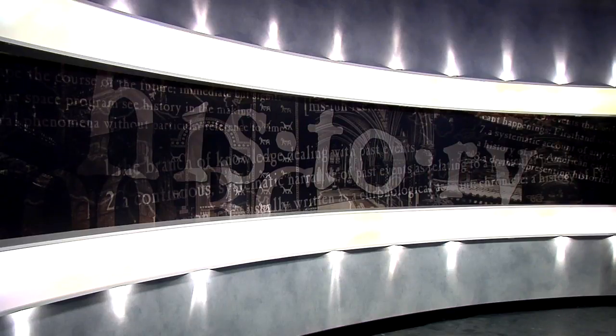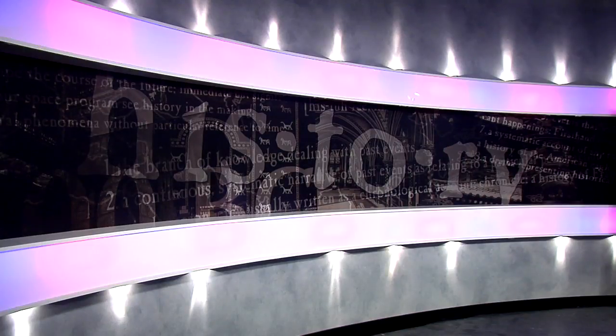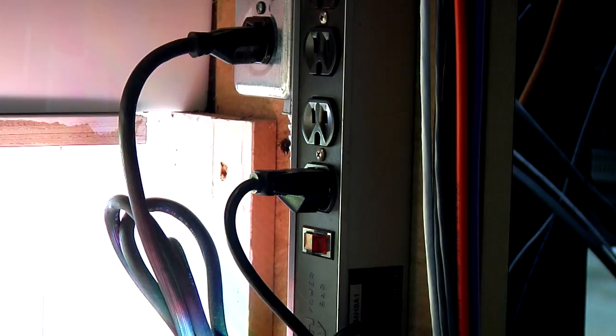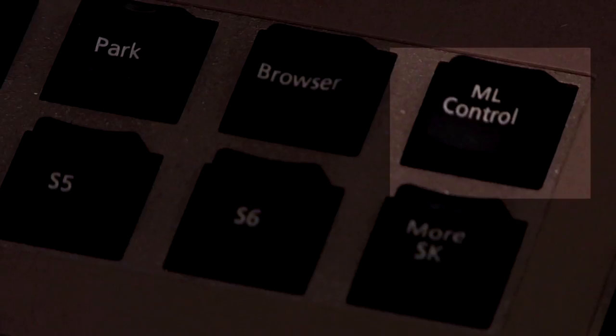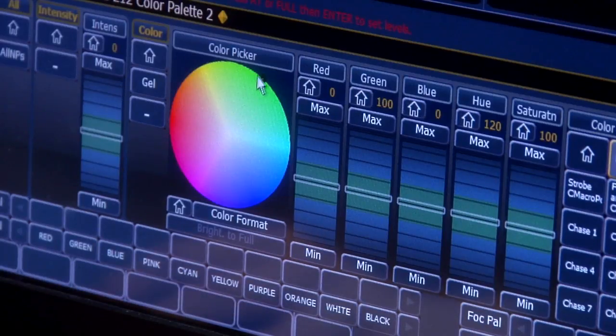We also have LED lights for the stage. The LEDs are used to set a more dynamic background, like a game show would have — wacky, zany strobing colors — while a news show would have straight and solid colors, like blue or green. To turn on the LEDs, go behind the stage and find the power bar they are connected to and turn it on. On the right screen, the LEDs are located in channels 201 through 212. You will have to press ML Control to bring up the advanced functions for the LEDs. You can use that monitor to access the colors of the LEDs and the way of illuminating themselves. There are many different settings for the LEDs and even presets at the bottom of the screen.